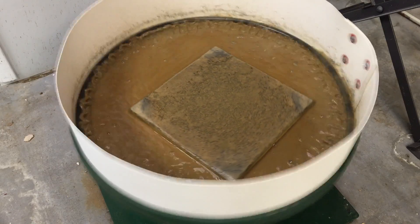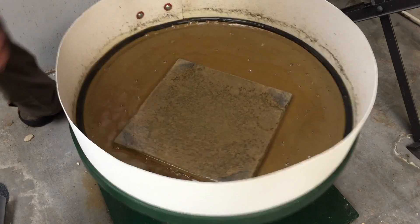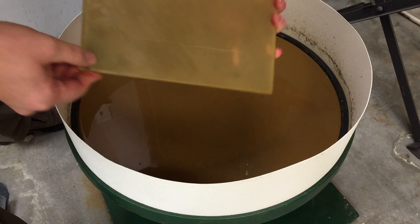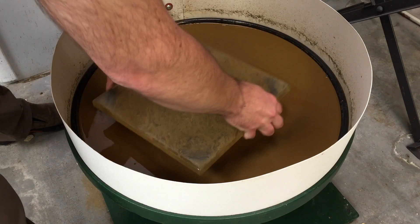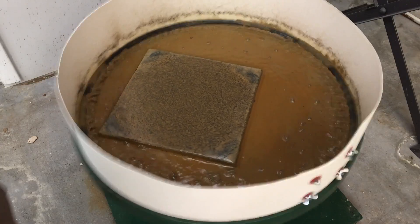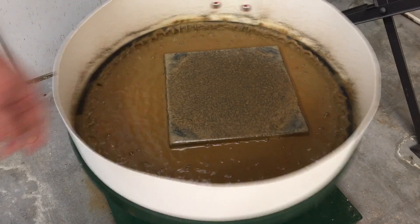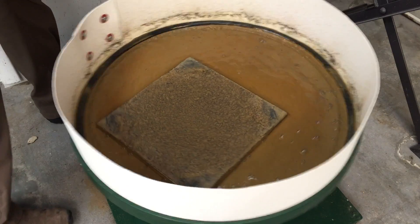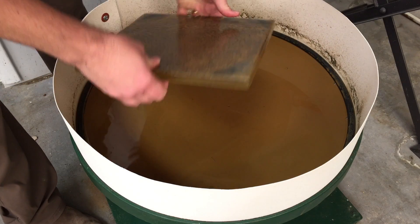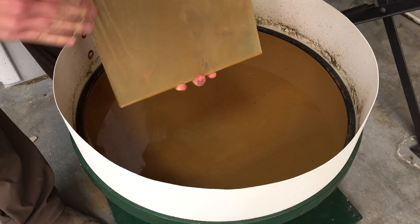Our 60 grit and the Reciprolap has been moving for about three and three-quarter hours now. I'm going to stop the Reciprolap, take our piece out, and check the status to see if it has ground down that surface. Looking at it — I can actually see we've still got a corner here that has not been ground yet, so I'm going to put this back in for a little bit longer. After about four hours total on our Reciprolap, that's looking pretty good — it has ground down quite nicely, giving a nice flat surface. Now also note that in the Reciprolap the water is very brown; this is rust happening on the plate, and that's fine. That's not a problem at all.